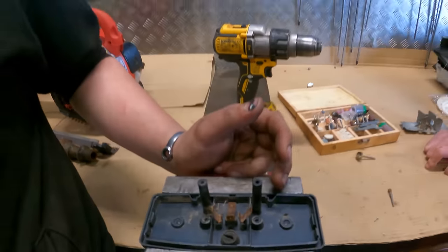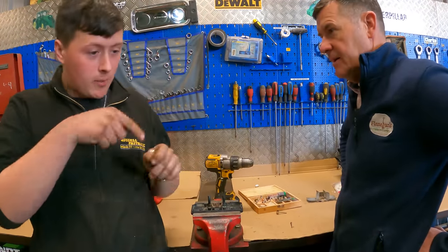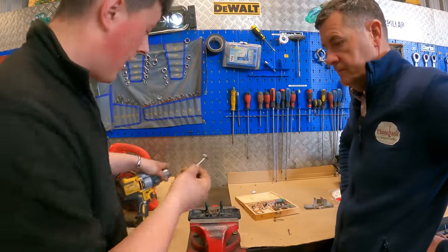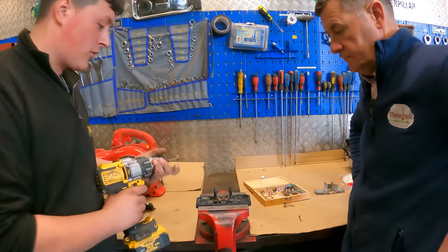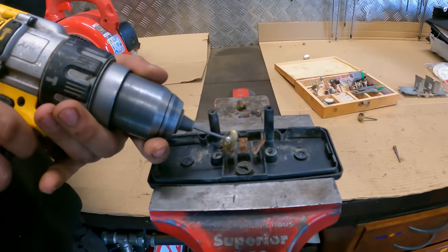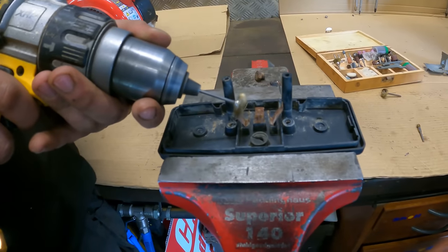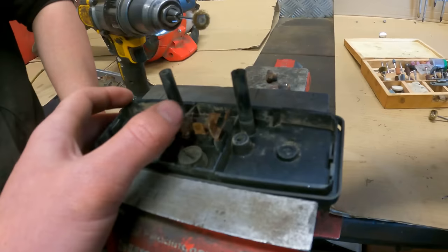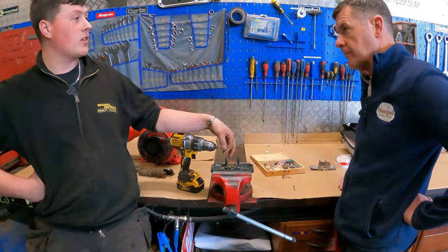Because I know myself, when you get a bulb and you put it in, and you twist it and turn it or whatever, you can go in there with a piece of sandpaper, put around the flathead of a screwdriver, go in and sand it up. But if I can go in on one of these, these are absolutely fantastic, because you clean them in a second. And they're just perfect. So if I put this in, speed it up. And see how well polished that is now. So your terminal or your contact is much cleaner than on that. Yeah, and it only takes 5 seconds to do, and with the little tiny size, you can get them in the most places.